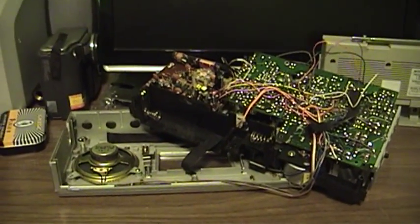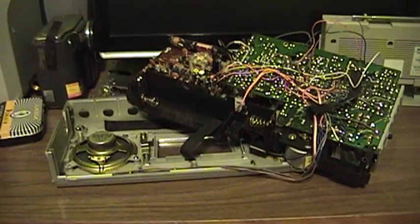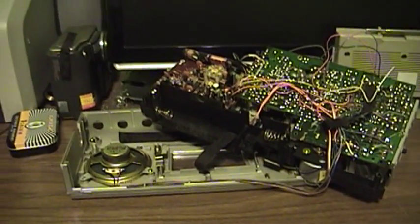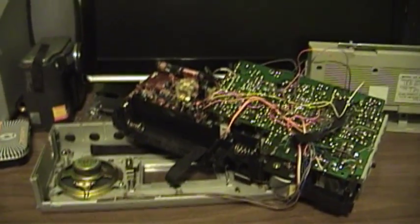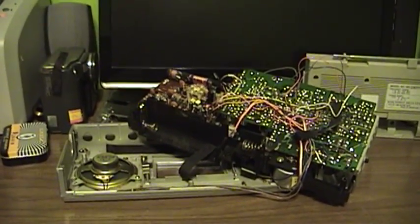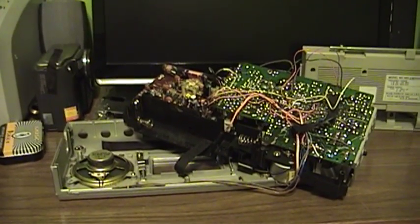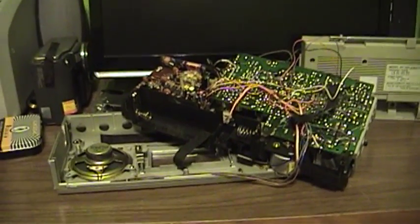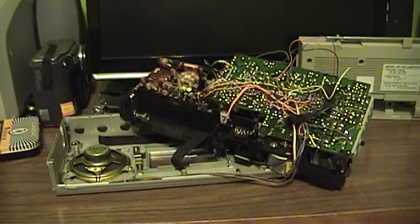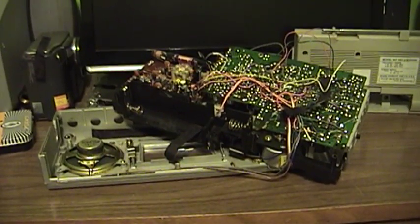It's uxwbill here, and this object should be pretty familiar, although maybe not in this state. This is the little Sears Boombox that I picked up at the Hamfest the other day, and as I mentioned in the video, I really thought the tape mechanism was working quite well, and it was just a matter of the crappy tape that I was playing. But it didn't take too long for the wheels to completely fall off of the whole tape system in this thing, and the speed to just go haywire, and of course the cause is simply belts.